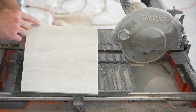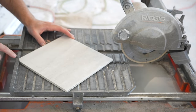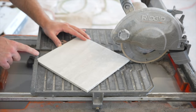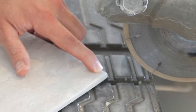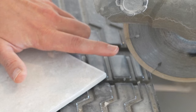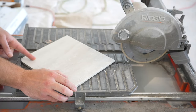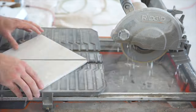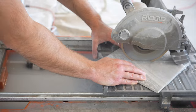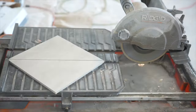I'm going to place the tile into the notch on the wet saw, line the peak of the square up with the blade, and cut it right in half. Since I need four shelves total I'll go ahead and lay out another piece of tile while I'm at it. Be sure to wear eye protection and ear protection when using the wet saw. If you're not using 24-inch tile you can also cut down 12-inch by 12-inch tiles down to nine and one-eighth to get the same result.